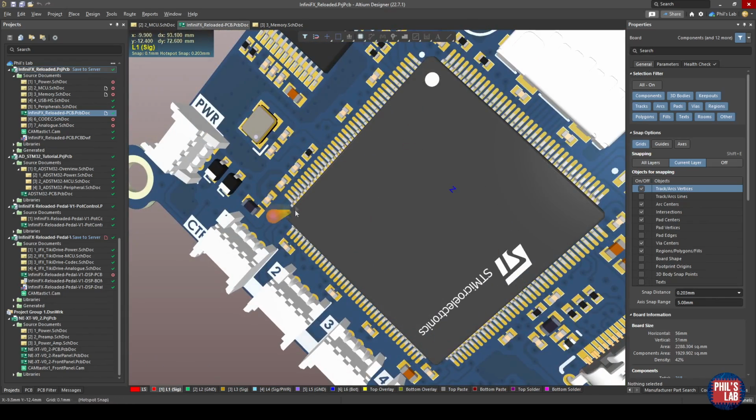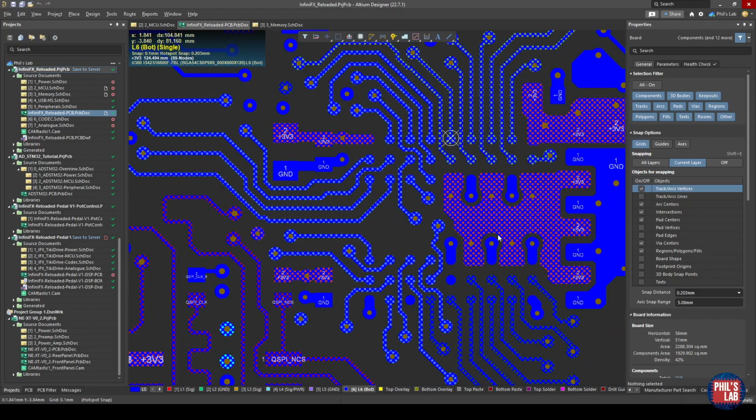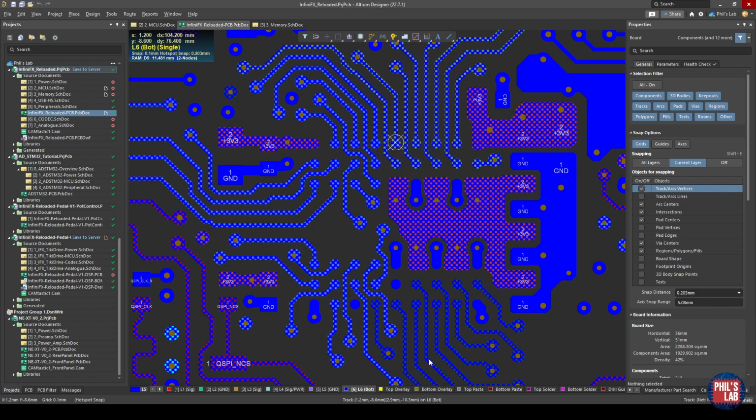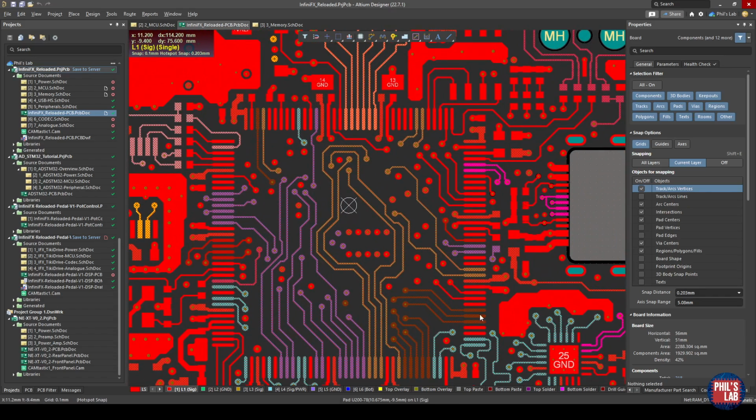This is because the address command and control, as well as all of the data signals, are all along the perimeter of this microcontroller. This way I can just route underneath, dig down and into my BGA. And thus, because I'm routing fairly equally along each perimeter side, I'm getting very closely matched traces. In essence, I actually didn't do any length matching because the traces are fairly similar anyway. It is slightly annoying to route out SDRAMs or DDR memories, but for this SDRAM I didn't pay too much attention to it. I essentially routed out as easy as I could, dig down to the top side, and then routed into the microcontroller pins.